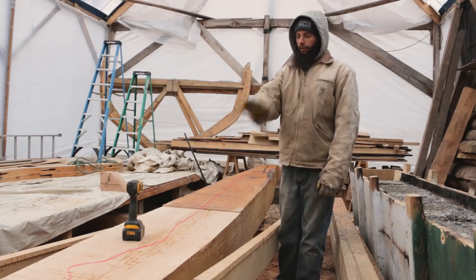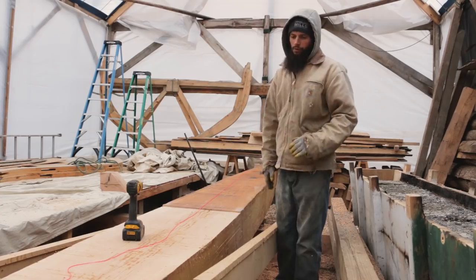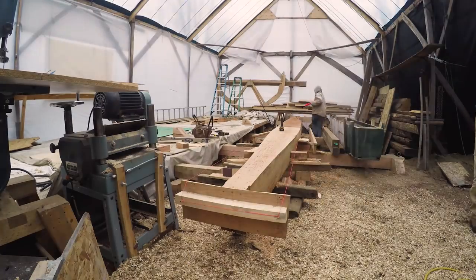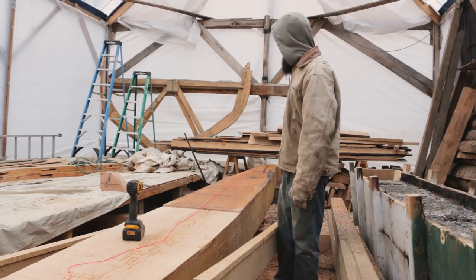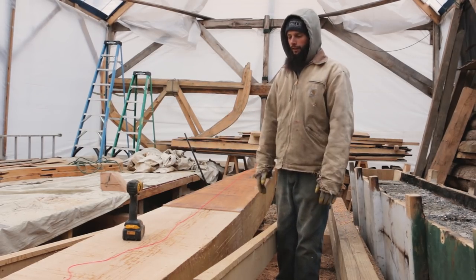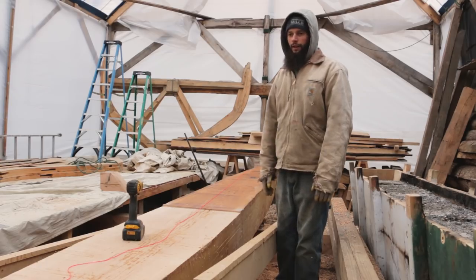Now that I've done the first part, I've got to move the rails. I won't change the ends where the string goes or the adjustments on the router — I'll just put the string back up and re-level the rails a little farther down, and everything should match up beautifully. I'll router a good chunk of the way down and have to reset one more time to do the last bit at the end. I'd love to get it totally flattened and get a coat of paint on it tonight so that tomorrow we can start working on the other side.